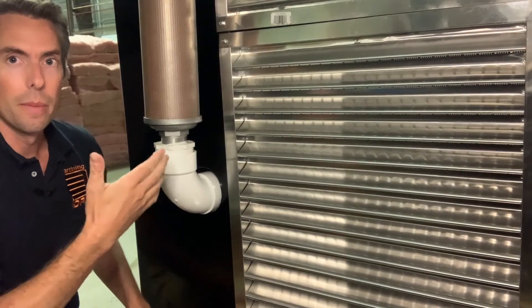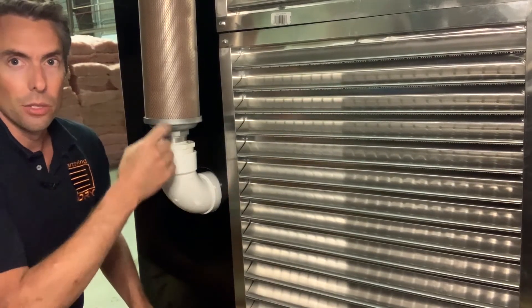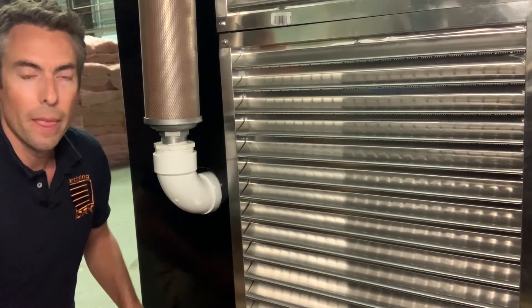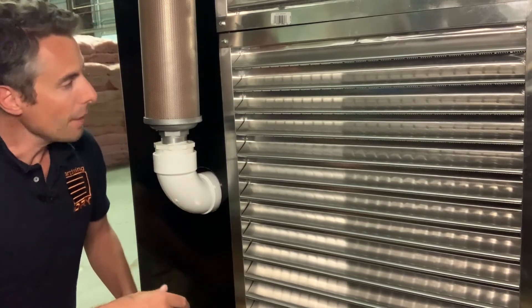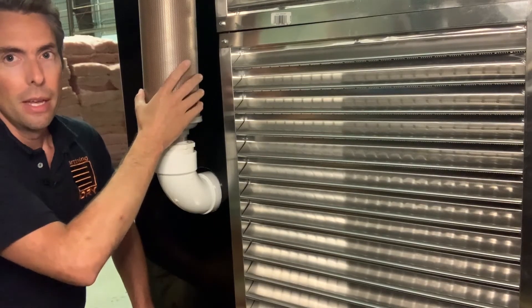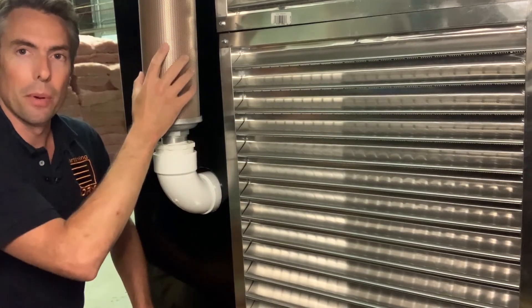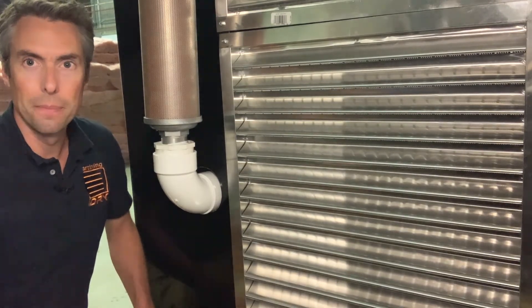I like to install mine up so that along with the air exhausted from the vacuum pump — which is the air you're taking out of the chamber when you're drying — there is also some moisture vapor. Rather than have that moisture vapor collect in this 5-micron filter and drip on your floor, I install it up so that moisture vapor condenses and drips back down and out your drain. I think that's the best way to do it. Thanks.